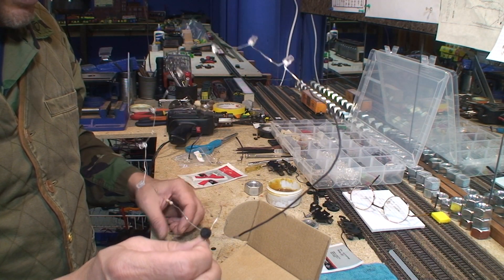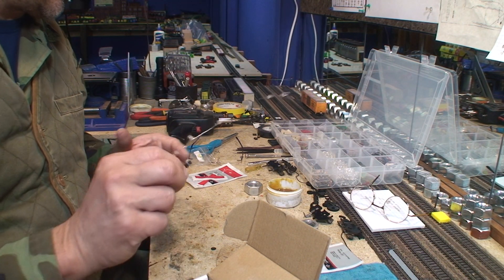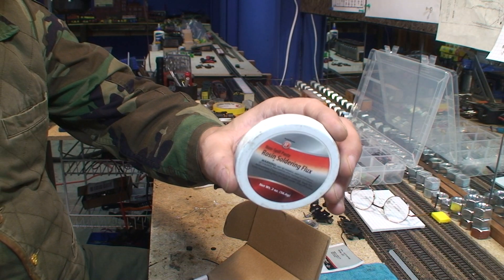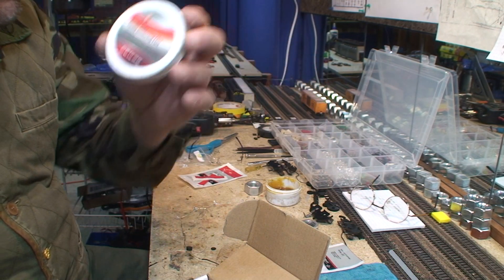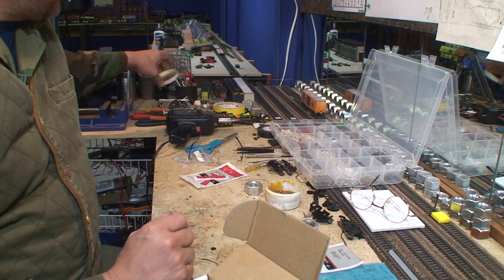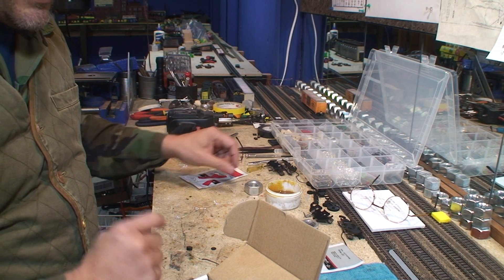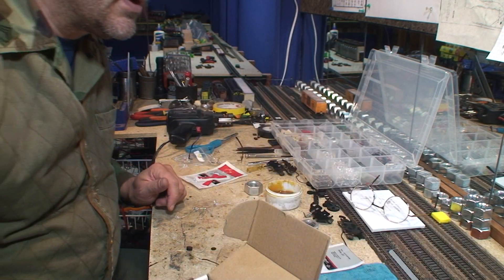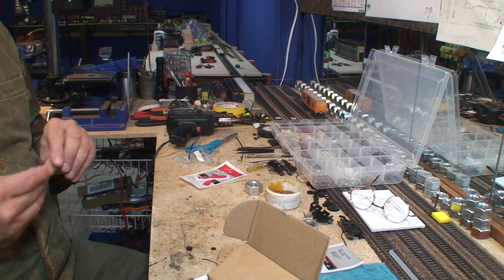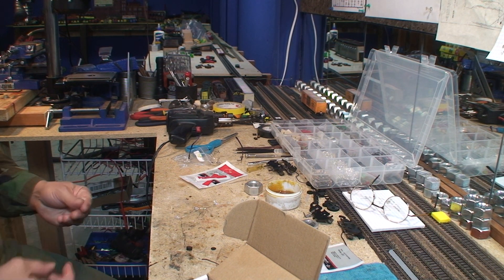It makes it a little easier to see and understand. You can use all the same color if you want — it doesn't matter — but I kind of like to have my stuff so that I know by looking at it what I was trying to do. Other things you will need are the rosin soldering flux — this is the Radio Shack stuff and my favorite flux — one thing of this lasts for a couple of years. And then I've got some fine solder here. I'm going to use the hot glue gun to keep the wiring in place. I like the hot glue gun because you can change your mind with it later, and once you put it down it's pretty much set in just a minute.